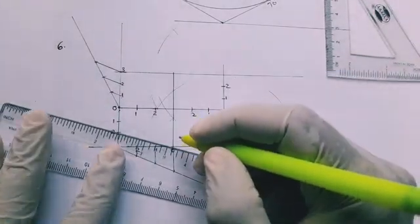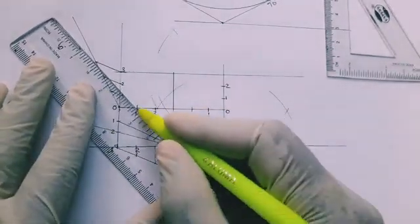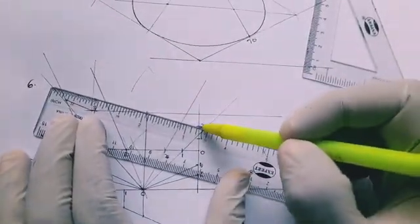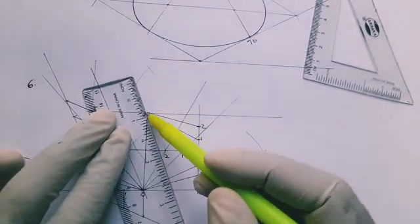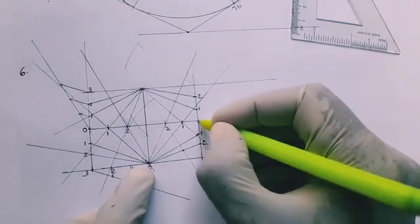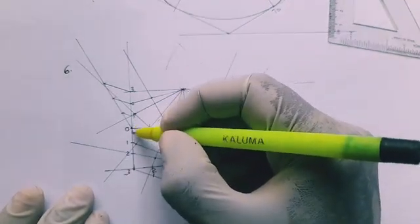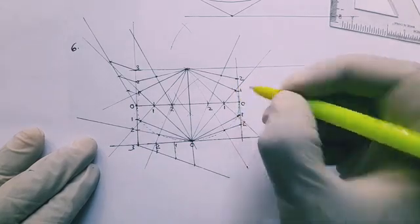Now join radial lines from the zero point at the lower part through number one, through number two, and through number one again on this side. Draw a straight line through each numbered point. Do the same on the right-hand side from the upper zero through two, through one. Points one-and-one and two-and-two on each side create intersection points. All four quadrants produce these intersection points.